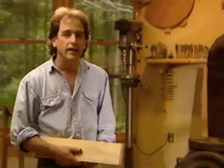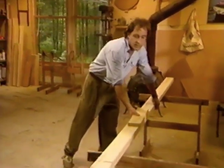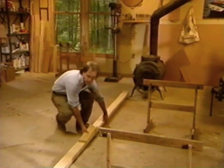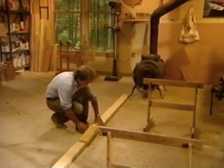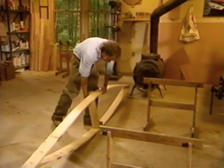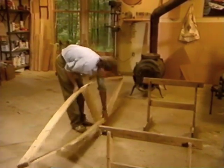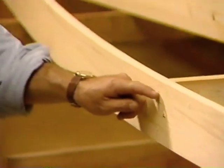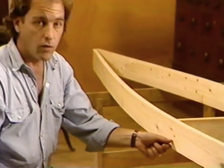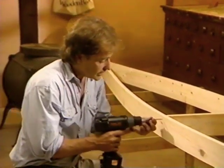In order to get our station molds to sit on our strongback, we need to widen it out. To do this, we insert a spreader piece in the center. We'll set this on the floor and spread it apart like a bow — we hope it doesn't break when we do this, because sometimes they do. With our strongback spreader in place on our center lines, drill a couple of pilot holes, then permanently fasten it with some three-inch drywall screws.